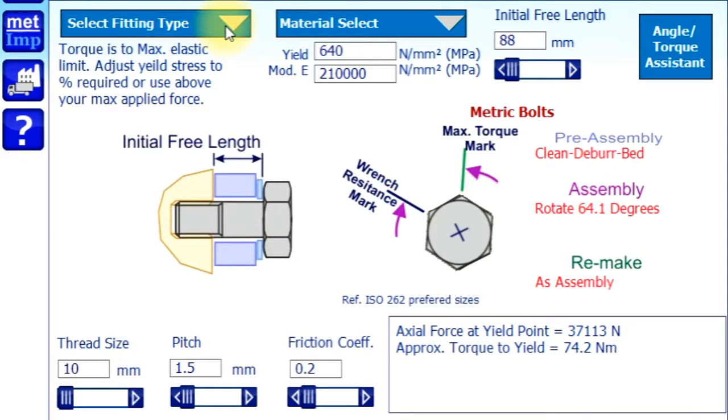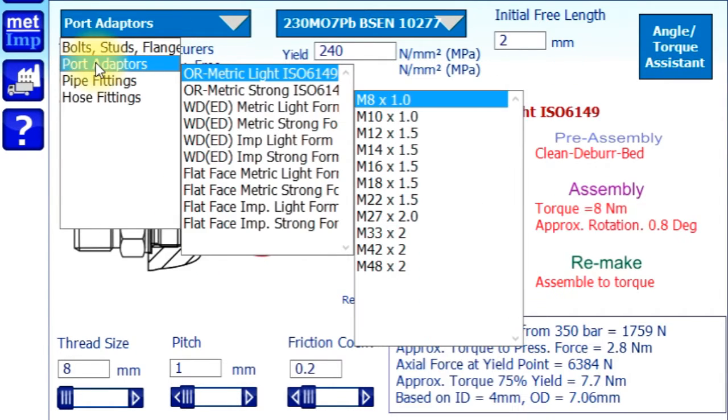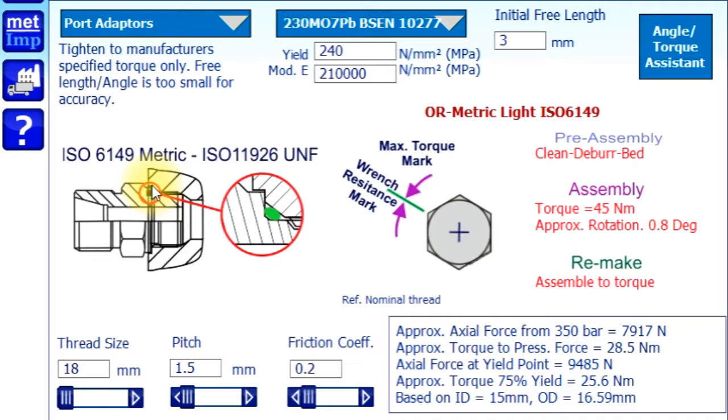And this is a nice simple way of checking that. Let's have a look at hydraulic port adapters to start off — there's not a lot we can do on these. But here you have a picture because there's no shaft. So really you're not going to rotate these at any angle at all because we haven't got any shaft to extend — it's just this narrow piece of material here. So really all this is doing is giving you some information: if you have a 350 bar pressure you get a certain amount of newtons, and that will give you a torque — so you've got to be higher than this. People will torque to yield, 75% of yield perhaps, so it gives you those values as well.